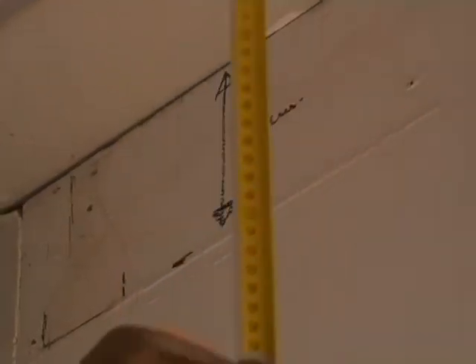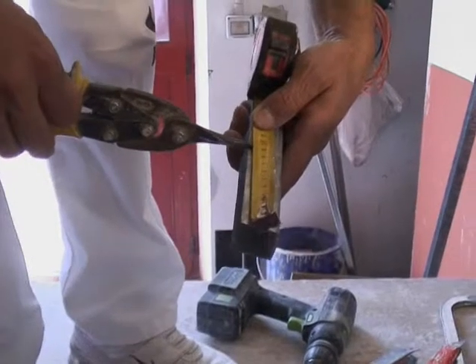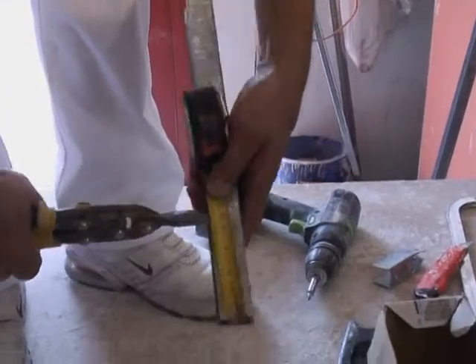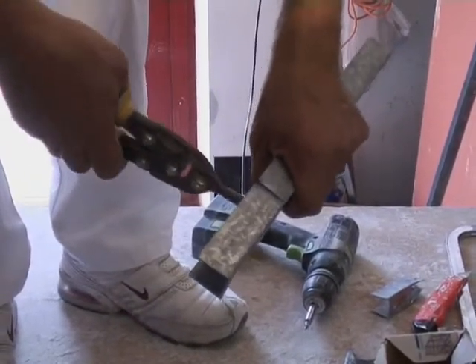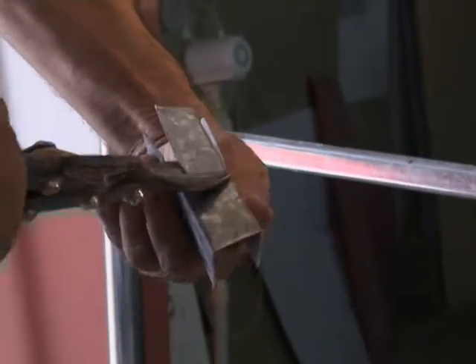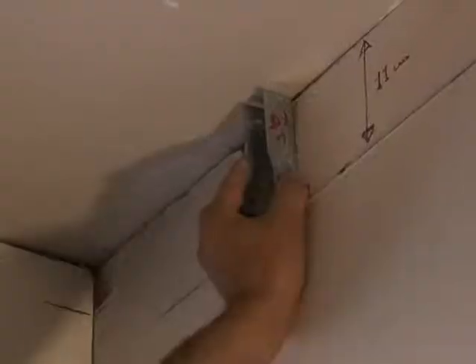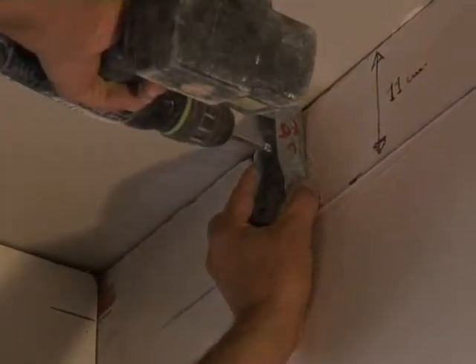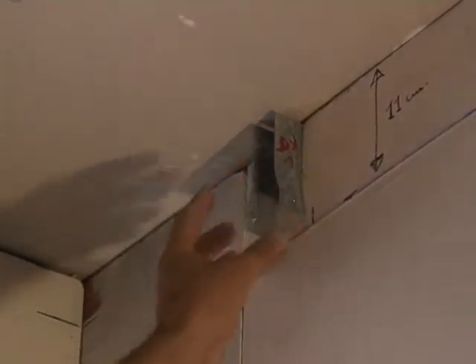On the side walls, place the supports 11 centimeters (4 and 5/16 inches) from the ceiling. Prepare the cross support at 9 centimeters (3 and a half inches). We suggest the following technique: cut and position the U-studs, cutting them in a way to make them rigid. Screw in the U-studs to the wall perpendicular to the flow of the ceiling guides at 78 centimeters (30 and 11/16 inches) intervals.